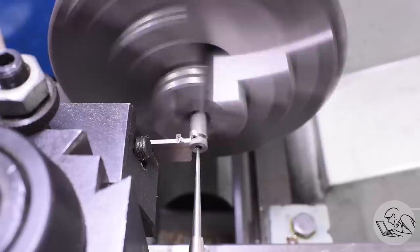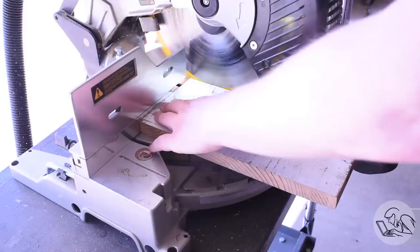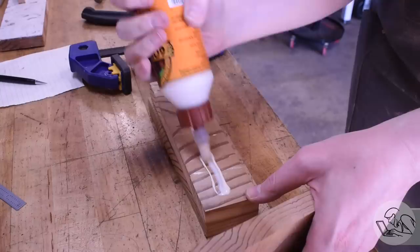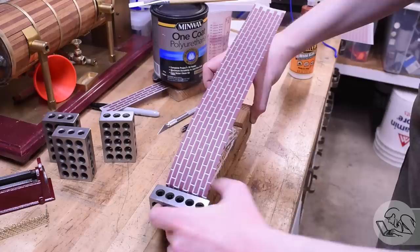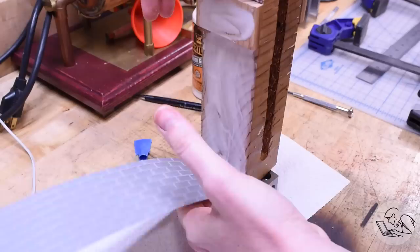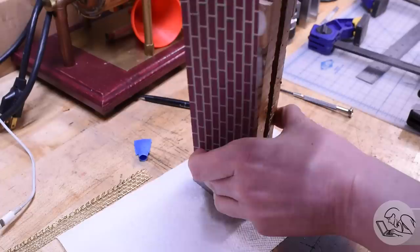I also made all custom nuts and studs from stainless bar stock because I didn't like the bolts that came with the kit — they're perfectly functional but don't really look right. We need a plinth for this engine to sit on, which I made from scrap wood. I laminated three pieces into a cross-shaped block and then used a dollhouse G-scale plastic brick sheet glued around the outside. Brick is kind of a traditional look for steam engine plinths.